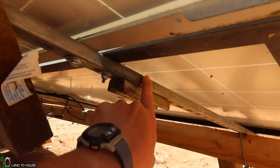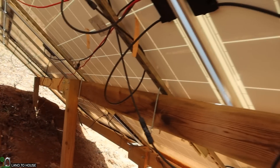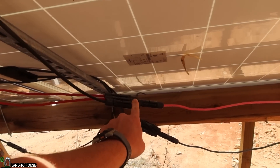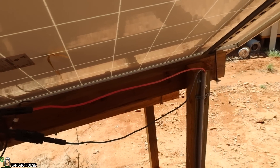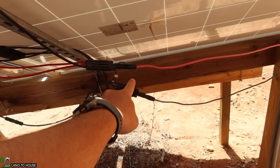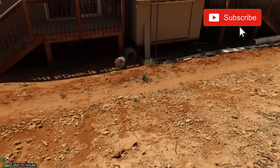Now, you'll see I had to link these pieces right here on the other links over here. I did not have to do that only on these four panels up top. As far as the wiring goes, I have three different rows of panels. Each row is set in series, and then those go in parallel — so it's series and parallel. That power goes into this three-way connector here, and then sends all the power down to the house. Basically, it's positive, negative, positive, negative, all the way down, and then the single positive comes back and hooks up there, and the single negative hooks up right there.